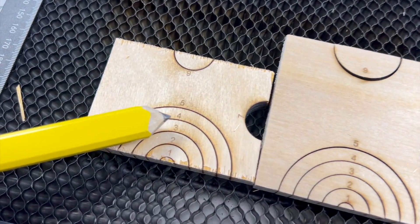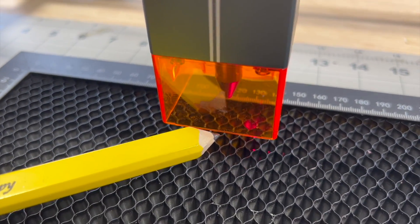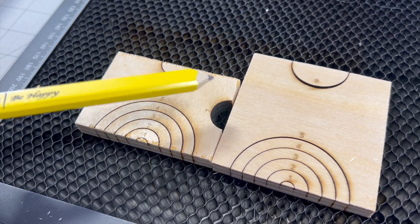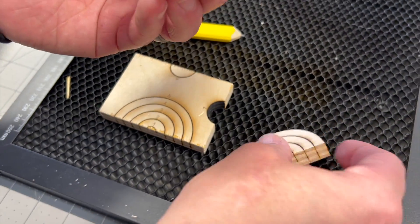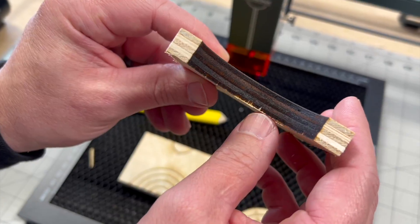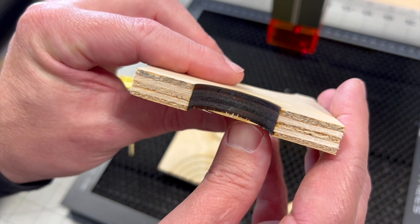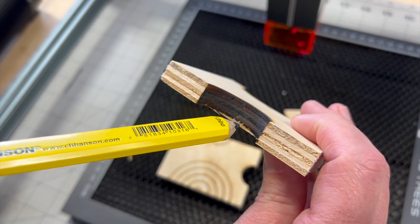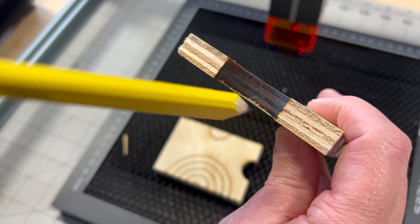I think the real reason behind that has to do more with our focal length. The laser itself may only be focused a certain amount down past the laser nozzle, and that may be why we can't seem to get cleaner cuts all the way down through this half-inch plywood. Because after we broke this apart, there's really no difference with five passes and six passes in how deep it goes. It almost gets to the other side with five and almost gets to the bottom with six.